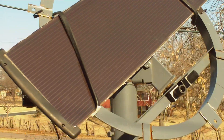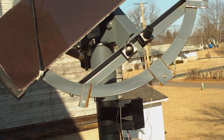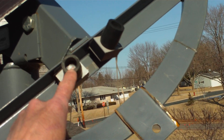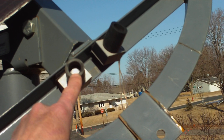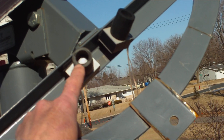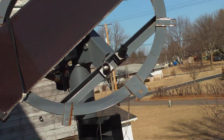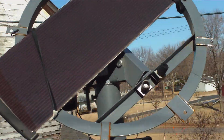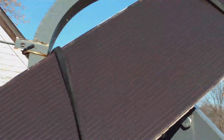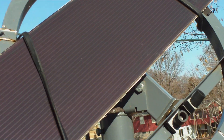This is my new solar tracker system, made out of RC — radio control — parts, basically, in the black box there. These two eyes are basically the sensors you use at night to turn your outside lights on at dusk and off at dawn. I just encased them in a little weatherproof housing. It's been tracking the sun just great — the sun is just over here a little bit. At night it returns back to home and waits for the sun again.